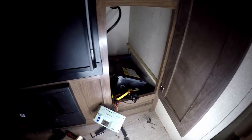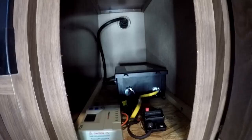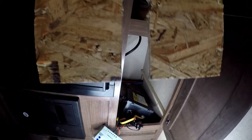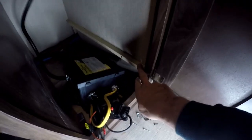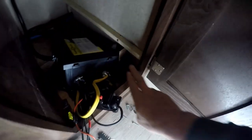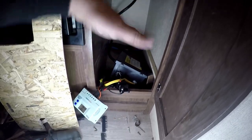I took a break last night, did some thinking, and this morning I decided to change up how the shelf is. Before, as you can see in this picture, the rails were on top of the shelf versus underneath the shelf to support it. So I pulled those out, put a notch at the very front to pull the wires out — there was already a notch at the back — and pulled those braces off. Now I'm remounting them using what I call a storyboard set to the height I want the shelf to be at. I set it there, put the screw in, move it back, do the same thing on the other side, and when I put the shelf back in it'll be level.